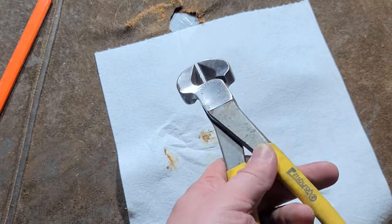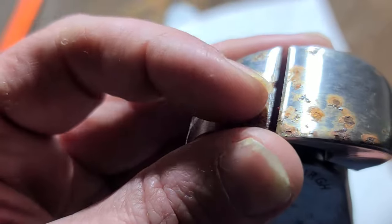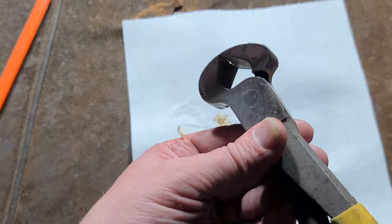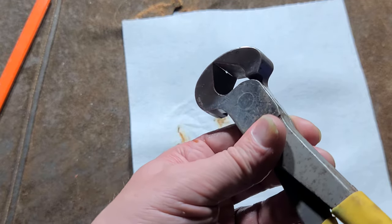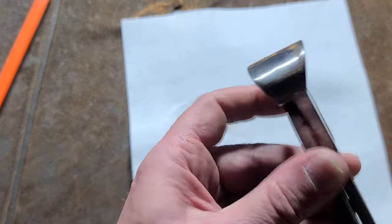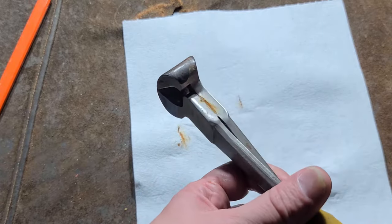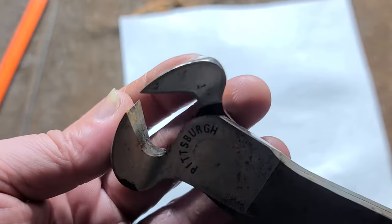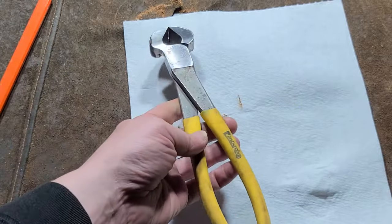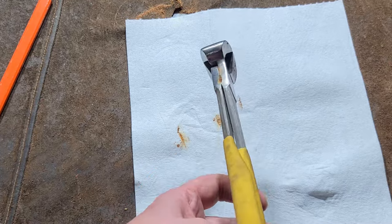These are going to work out, but they're either going to be some carbon steel or a cheaper grade of tool steel. But for a lot of uses that's just fine. They don't always have to come all the way together. If you're using these to work with mild steel, tie wire and that type of stuff, the jaws will last just fine. If you want to use them harder — cut the heads off of nails, cut heads off of screws, bite into the sides of fasteners and extract them, or even the stems of broken-off bolts — when you have a pair you're willing to beat up, just being able to pinch down with a huge amount of force is surprisingly handy in a variety of plier-type situations where you're not even using them for cutting.